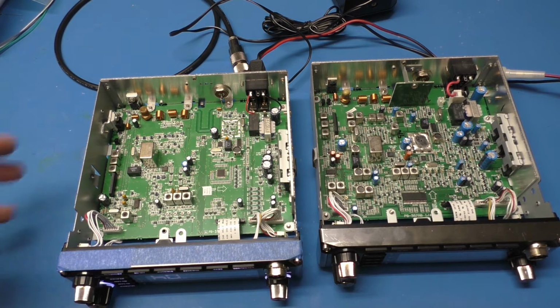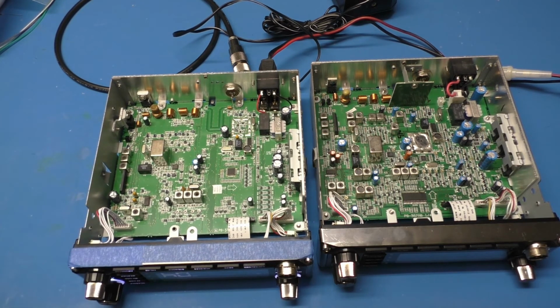You know, when you go to the extreme edges of some of these radios, you get like a downswing where there's not enough power there. So that's 1 watt with a forward swing. It ain't the best thing in the world, but it's a forward swing. You go any lower than that 1 watt, and the radio is just swinging down. You just don't have enough. So 3 megahertz. So that's pretty damn good.